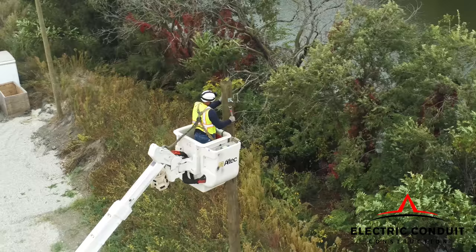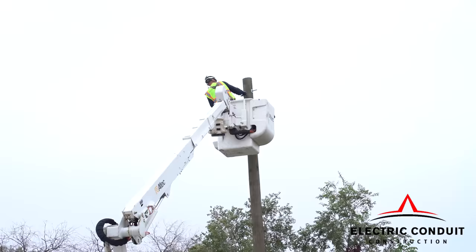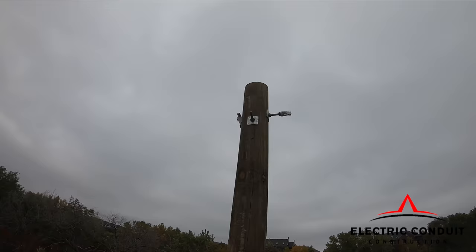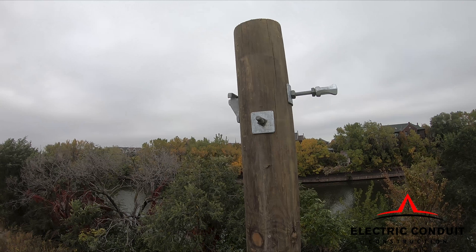Lashed fiber requires a messenger wire or strand for support. Pole framing and hardware attachments are similar for both lashed and ADSS fiber installations. In this photograph, the pole has been framed out for an overlash installation of messenger wire to create a false dead end. On the right, a thimble eye, on the left, a ram's horn, which will lead the strand to an anchor and down guy.